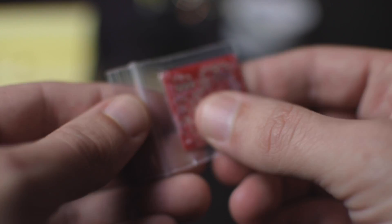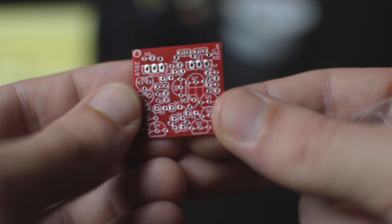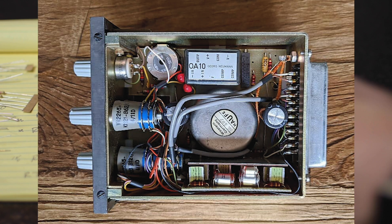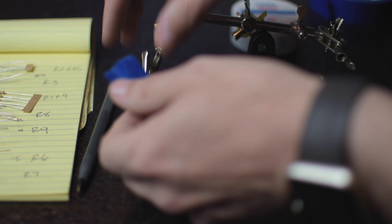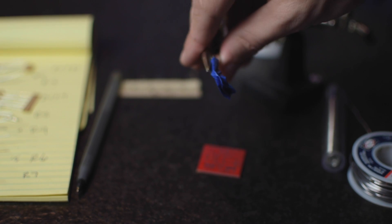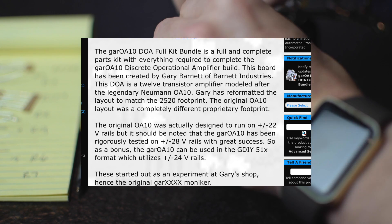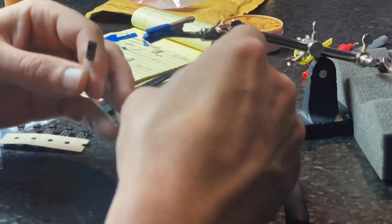This board has been created by Gary Barnett of Barnett Industries. This discrete op amp is a 12 transistor amplifier modeled after the legendary Neumann OA10. The original OA10 had its own proprietary footprint, so Gary redesigned this to fit a 2520 to make it more universal. The original OA10 was designed to run on 22-volt rails, and the GAR OA10 has been rigorously tested on 28-volt rails, so it can be used on 24 volts or anything under — it's rated 12 to 28.